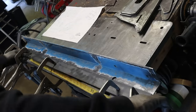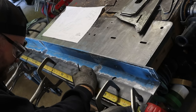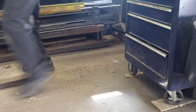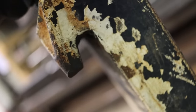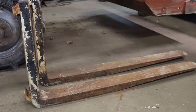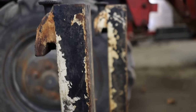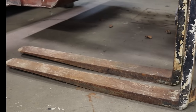After that, I mark the positions for the notches. For the non-forklift user, standard forks have a spring-loaded locator. I'll get the forks and show you. This is the locator that will slide into a notch to keep the fork in place. If you want to make your own pallet fork attachment, I highly recommend buying an old set from Craigslist or Marketplace. Don't even bother making your own set, because these are heat-treated and they will flex under a heavy load when regular steel will bend. I paid 200 Canadian pesos, which is probably equivalent to 20 US dollars.